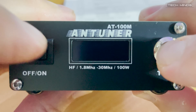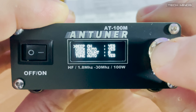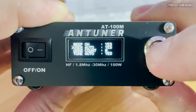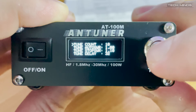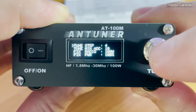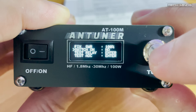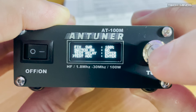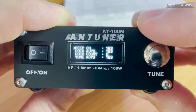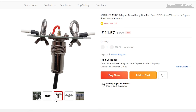If you power on the AT100M while holding down the tune button, it goes into a setup menu. From this menu you can change things like the beep sound on or off, enable or disable manual or automatic tune, the auto-tune trip level, and the auto-tune stop level. You can also adjust tuning steps and perform self-tests like ADC checking or checking the internal relays.